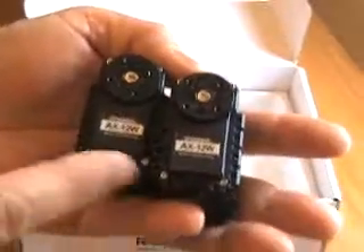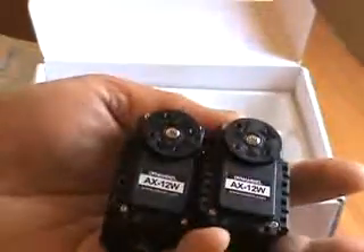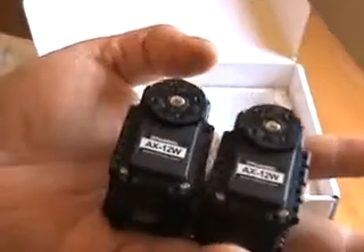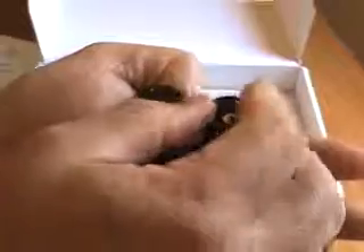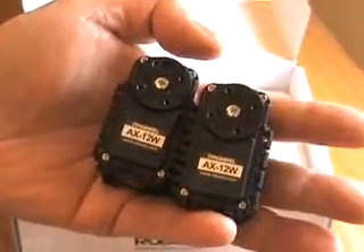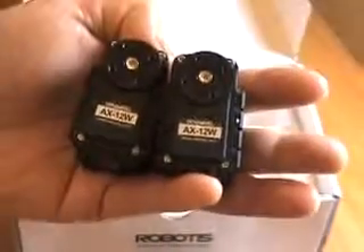We have two servo only — you can see AX12W. Outward-wise, physically, they look the same shape and everything, but it runs much faster at 470 RPM. The website didn't say anything about maximum torque, but I expect it to be low. The gear ratio is very different — it's very light, you can turn it now. If you already have an AX12, when you turn it you can feel the gear ratio is different and it's very hard to turn, but this one is fairly easy. So very high speed, but I expect the torque will be small. That's why it's best to use them as wheels.